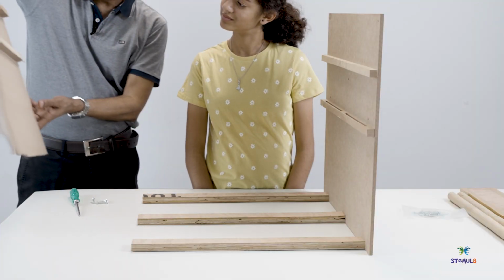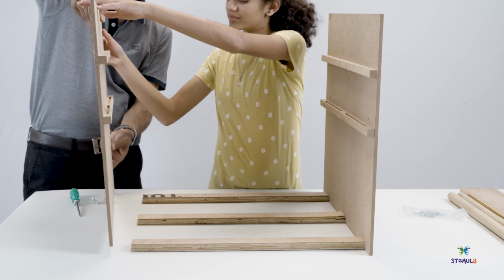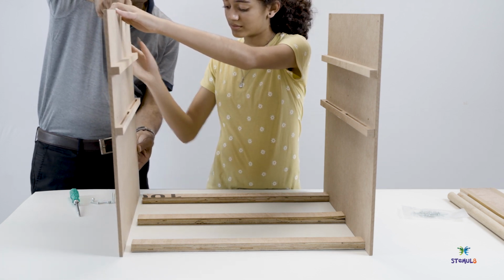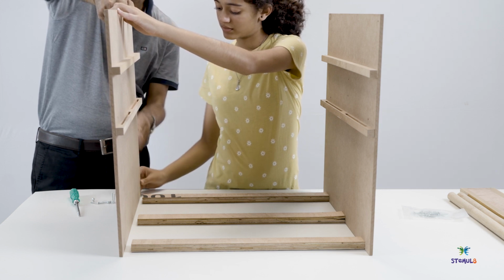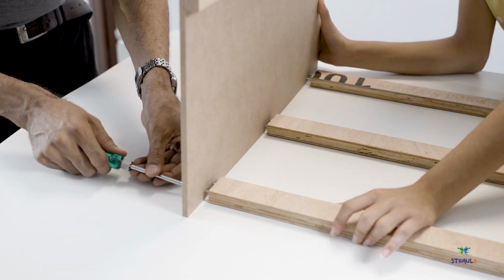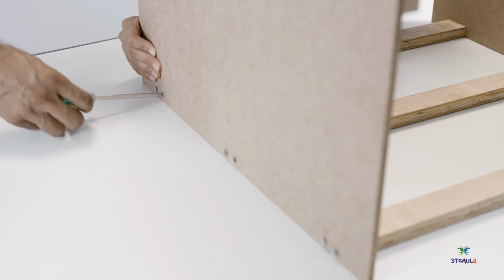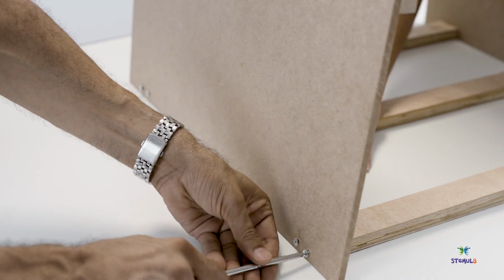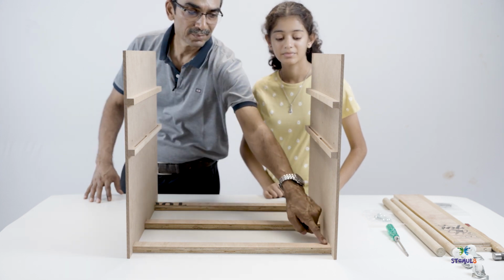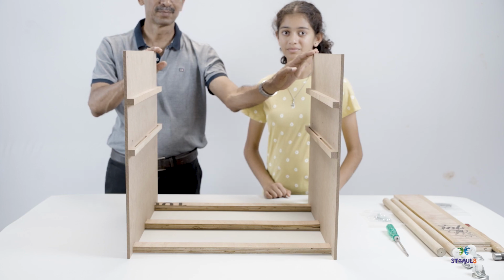Get another panel plate and align the bottom strips. One person must hold the panel while your partner can align the strips. Hold the panel vertically, and the plain side should be facing out. The one with tray support strips stuck on it should be facing inside. Now insert the screws through the holes on the panel and repeat what you did earlier to fix the panel. Tighten the screws, though not completely. Both the panels are now attached to the bottom support strips. The structure can stand on its own though screws are not completely tightened.